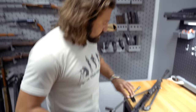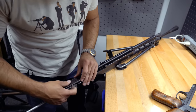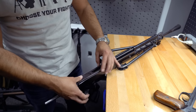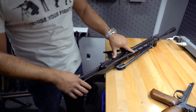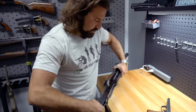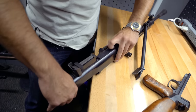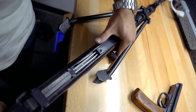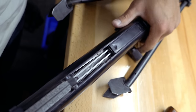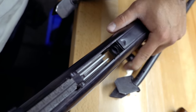Back to reassembly: we're going to line up our piston and our gas tube, line up the little grooves on the side of the bolt, go through the receiver, and we are back in battery. The cool part is if you flip this upside down — and open the dust cover — you can actually see the flapper lock mechanism working. It's fully in battery; you see those flaps deploy and then retract.